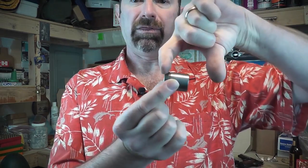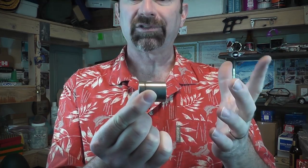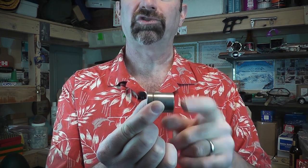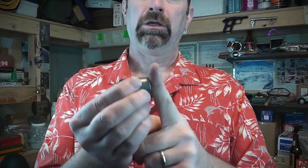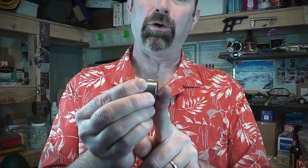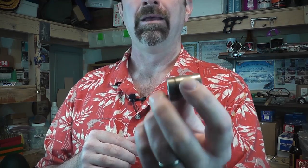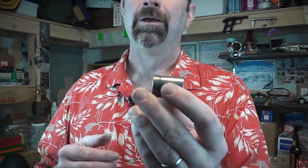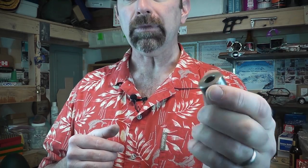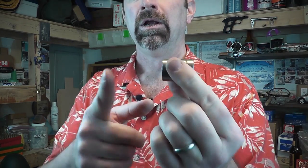The overall length of the gauge is equivalent to the maximum length of the cartridge. The max length for a .45 ACP cartridge is 1.275 inches, so this gauge is 1.275 inches long. After you've dropped a round into it, you can look or feel for the end. If the bullet is not sticking out, it's within maximum length. I rarely load rounds to max length — usually 1.25 to 1.265 — but this will tell you if your round is over max. If it's over max, it probably won't fit in the magazine, let alone the chamber.